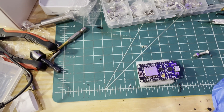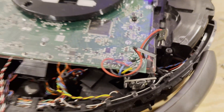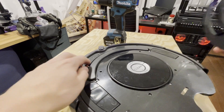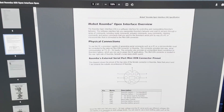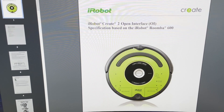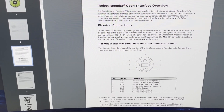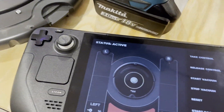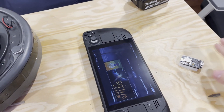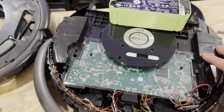I won't go through the code too much, but it's pretty simple. I've taken an ESP and hooked it up to the serial interface on the Roomba, and shoved it up inside the Roomba — I wanted the Roomba to have the same top plate and not have an exposed plug. The older Roomba I have doesn't have Wi-Fi, but it does have a serial interface. iRobot defines an open specification that they publish which you can use to communicate and control your Roomba for robotics applications. The ESP takes UDP multicast messages from the app running on the Steam Deck, so as long as they're on the same Wi-Fi, the commands from the Steam Deck are forwarded over UDP and then sent through serial to the Roomba itself.